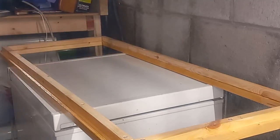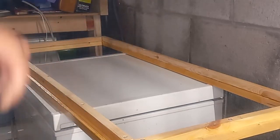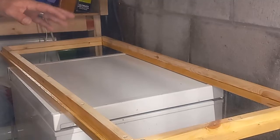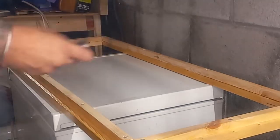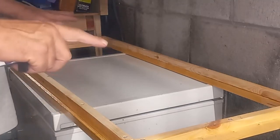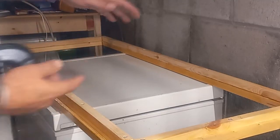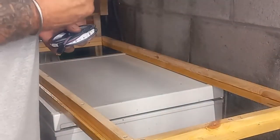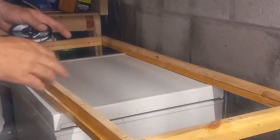Once I get that in there, and the pieces I'm putting on top of the mirror, I painted black. I just hit them with a can of flat black spray paint. I figured it might help with the LEDs. And now, once I get the LEDs in there, and they're all set, and these are two-sided tape on the back of them, so they just adhere in there. Then the other piece of glass goes down on top of that shiny side down. You want the two mirrors pointing at each other. And then I'm going to rim that again with this all the way around, glue it down.